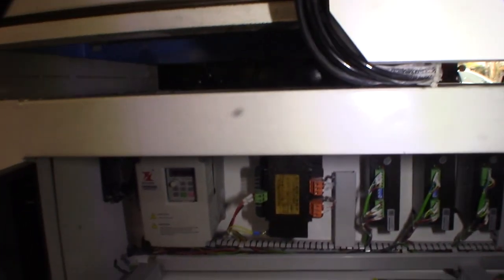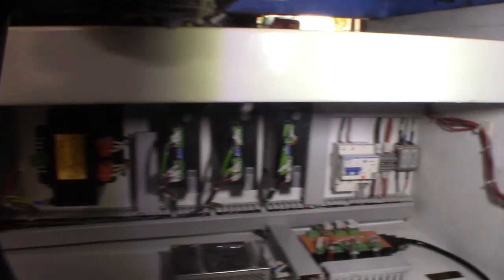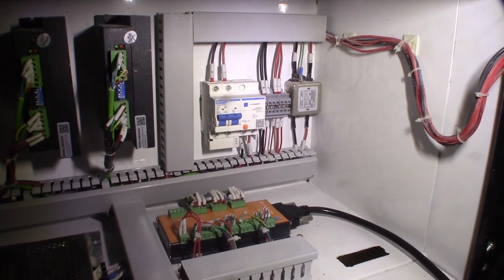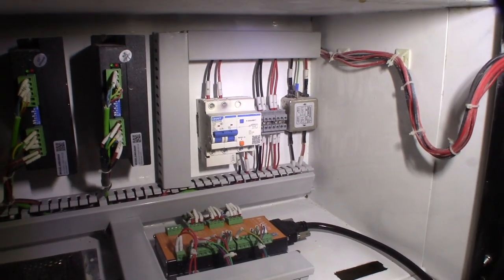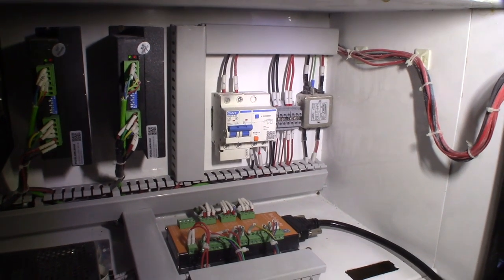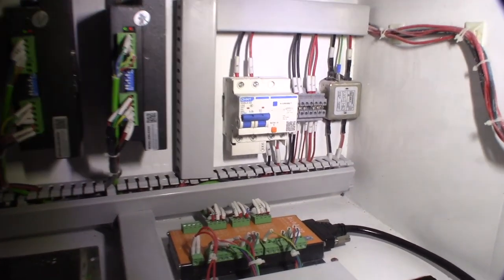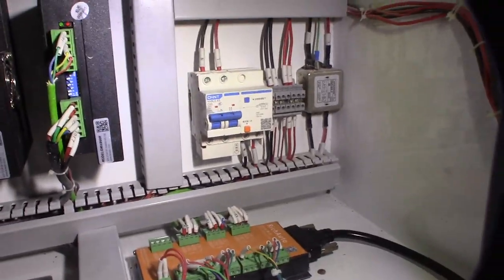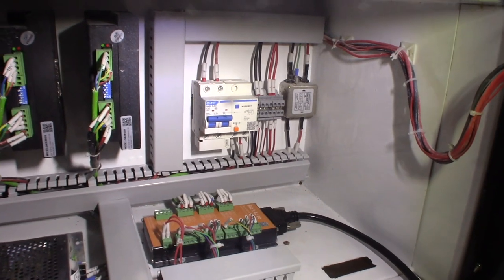Since it's already wired like that, I should hopefully just move the wires over. One thing I want to do is get spindle feedback — index back in Mach 3 — so I can actually control the spindle and get the true RPM ranges, getting feedback from the VFD in Mach 3. There's also a touch probe on this thing already I need to figure out. I notice on the right-hand side there are two 5-volt lines, so it's ground-triggered — the step and direction are ground-triggered with a constant 5 volts.